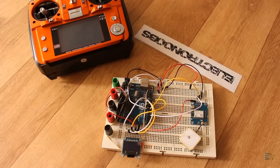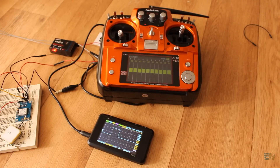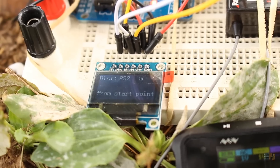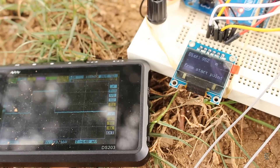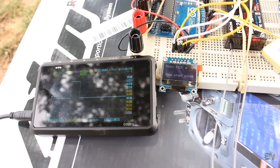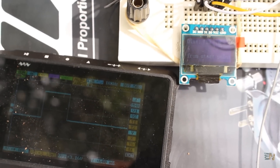In order to test the range I used a GPS module and the Arduino. I connected the receiver to my mini oscilloscope and started a test loop that increases and decreases the pulse width. The Arduino prints on an OLED screen the distance difference between the start and end points. On open field I received a good signal at 800m, 900m, and even up to 1.2km. At higher distances the duty remained the same as the last received value. Inside the city, depending on position or obstacles in front of me, I had a perfect signal up to 800 meters.